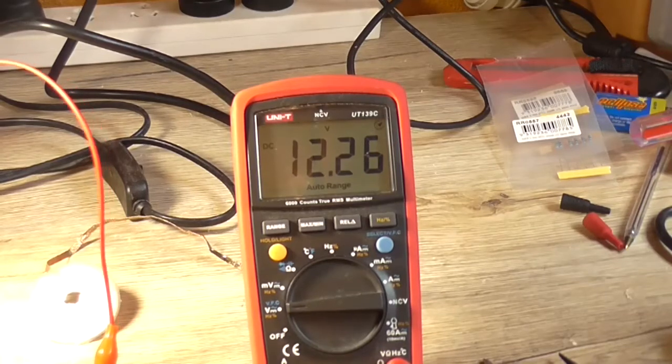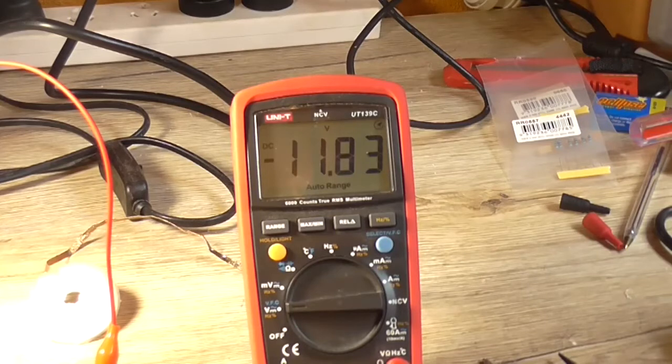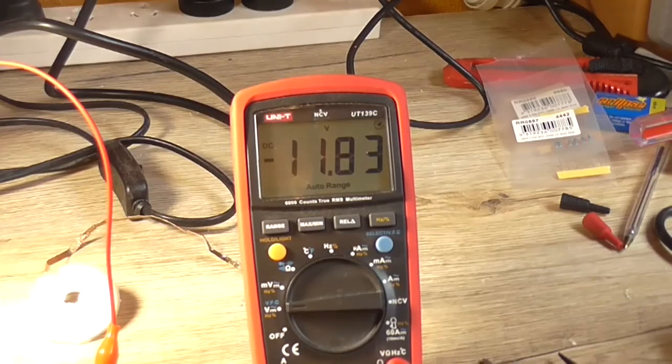Yeah, I think I'm using the wrong value resistor. It shouldn't be 240, it should be 120, I think. I'll have to check that, but even with the supply voltage up full, it's not going to make any difference to regulation. So the values of the resistors in there are what set our output voltage. So I'm just going to have a quick investigation of something here, quick.